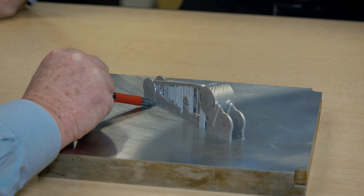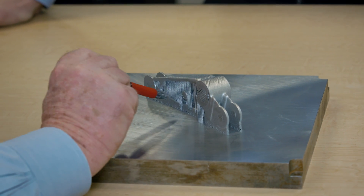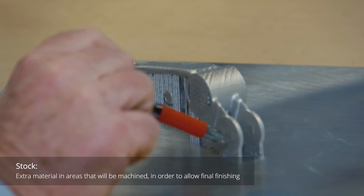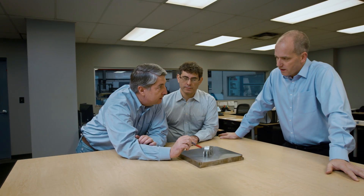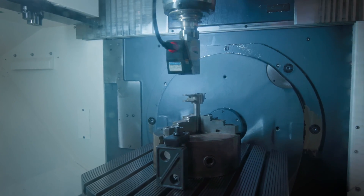So where do we go now? This part, great looking, kind of cool, but not what we need in order to have a functional part. So what's going to happen next? We're going to take this part that's on the build plate into the workshop and cut the part off the build plate. Then we will mount this part as-built onto a machining center. We will do an initial scan of the part to determine the stock that is on the part and make sure that we have plenty of stock in the areas required for finish. Then we will machine the part, and from machining the part, we will scan the part and make sure that it conforms.